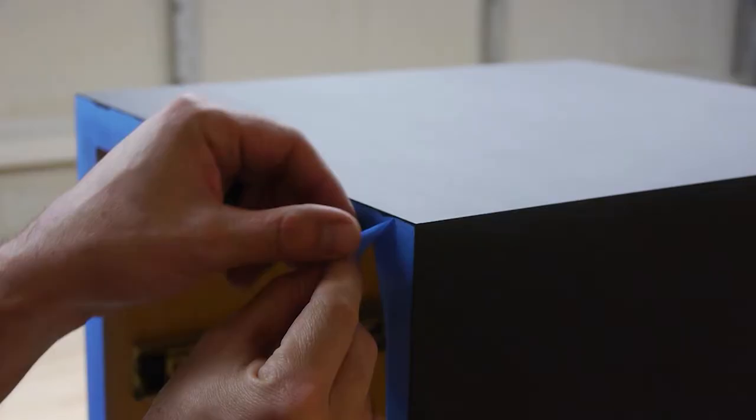A little bit of difference between this paint and the final, because I put a protective coat of finish over top of all of this, and I put it on too late at night. It was too cold in the shop, did not cure right, had to try and sand it back. I was unsuccessful at that, so I had to repaint everything. In hindsight, I'm glad that I did, because I like the final design on the drawer fronts better, but certainly a live and learn situation, and also, shit happens. Okay, let's get back to it.